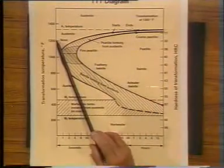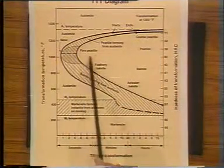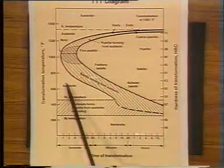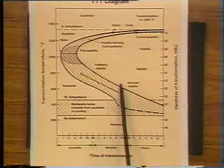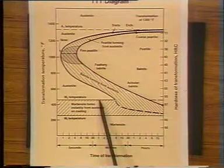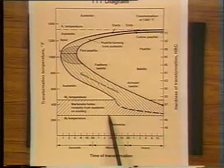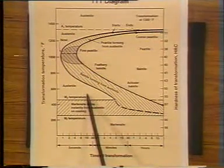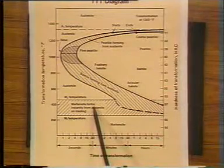In isothermal transformation, cooling the material rapidly to some temperature gives coarse pearlite. Dropping to a lower temperature gives finer pearlite — a harder material, equivalent to quenching in heavy oil. Dropping to a still lower temperature gives an even finer material now referred to as bainite, named after the man who developed the chart. Cooling very rapidly and holding allows the temperature to drop further, transforming to martensite beginning at the Ms line and finishing at the martensite finish line. It then became possible to quench into this range, hold to equilibrate thermal stresses, then drop to form martensite without the drastic distortion of direct quenching.